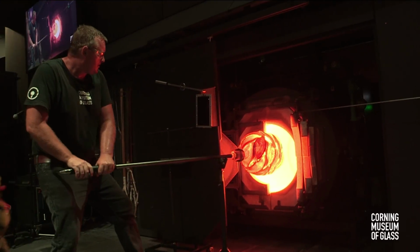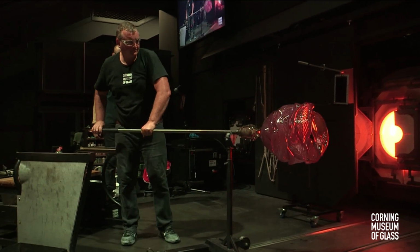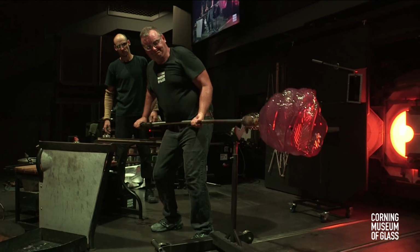And then also the shape. That little bit is a constriction, with a really smooth kind of curve to it. If it had a very abrupt line, like a visual line that you could see cut into the glass, that's a very weak area in the material. So as long as that little connection isn't any smaller than, let's say, the diameter of the iron, we really don't have to worry. I'd worry about maybe the iron breaking first.